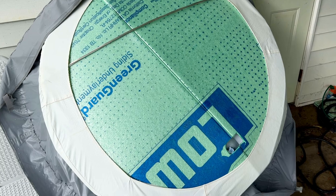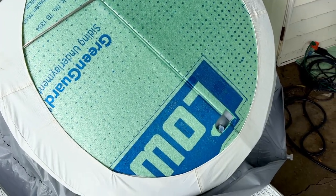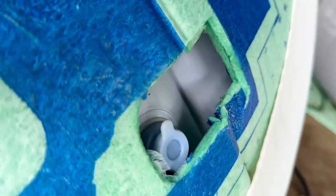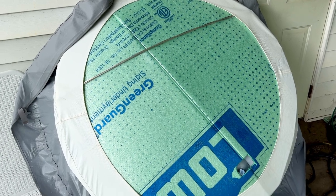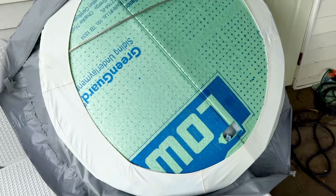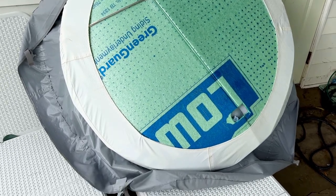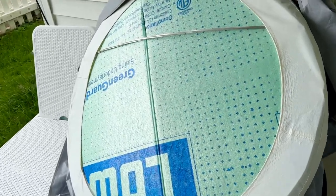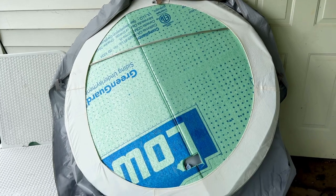The other thing I did was I insulated my cover. I got some fan-fold insulation from Lowe's — this is just quarter-inch green board fan-fold insulation — and I folded it over so it's double the thickness, giving me about a half inch. I deflated the cover, traced it out onto the insulation, and cut it with a utility knife. I put the insulation inside, left the plug open so I could still air it up, then blew it up and it holds the insulation in place as one solid unit. Just this alone really keeps the heat in overnight.